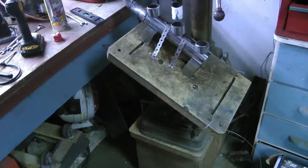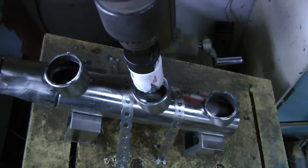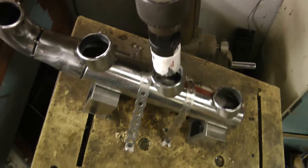After I built the driver's side I broke all the tacks. Lastly I drilled out the log with an inch-and-a-half hole saw and cleaned up the welds a little bit on the inside.